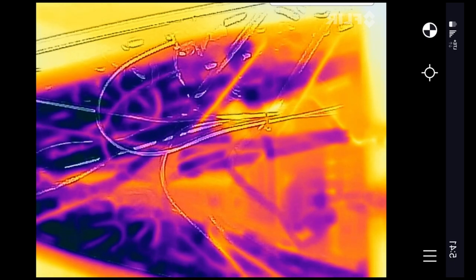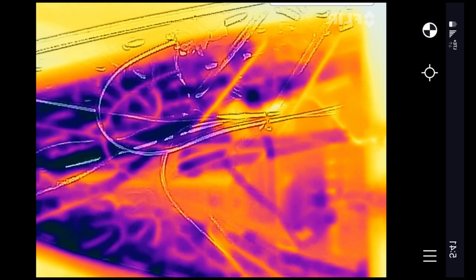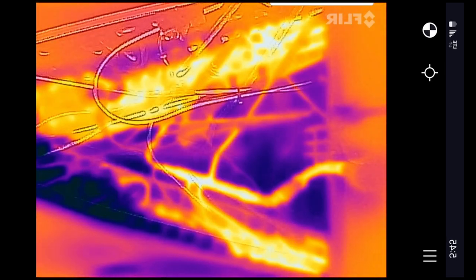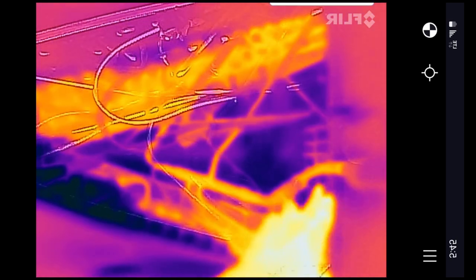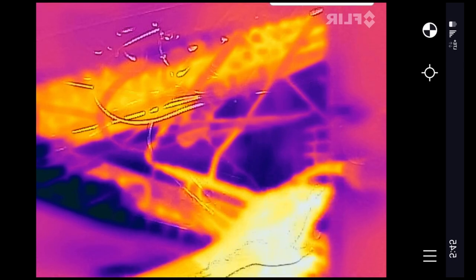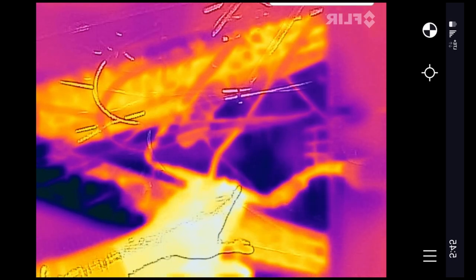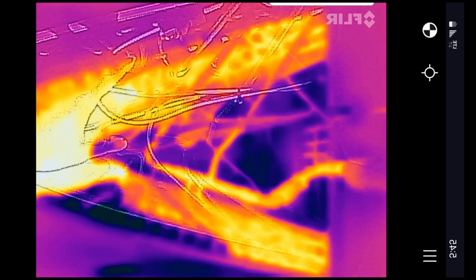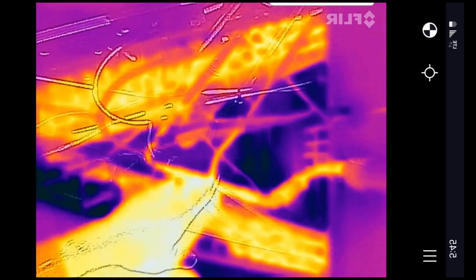All right, the system cycled off. We changed it to have a call for heating, so the reverse valve is going to de-energize. Now we have a call for heating, so it's in heat pump mode. So we should be sending hot gas in here through this line. What was the suction line is now the discharge line. We're sending hot gas into the coil, and it's de-superheating, changing state from a vapor to a liquid, and it's going to be sub-cooling the liquid.